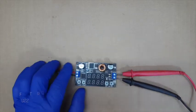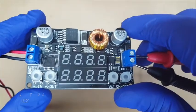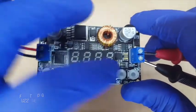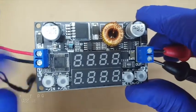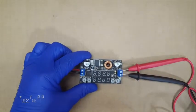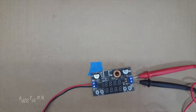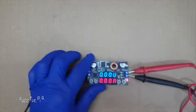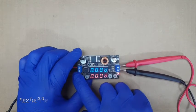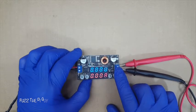Fuzz Pie Guy here. You're looking at a DC step-down voltage converter. As you can see, we've got two little displays — top one for voltage, bottom one for amps. We have our in and our out. I just have this hooked up to my meter and I'm powering it off a USB right now just for the purpose of this video, so we're doing five volts coming in. This is good for 5 to 32 volts in, with an output of 30 watts at 5 amps.